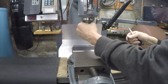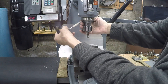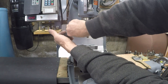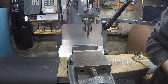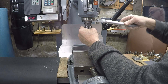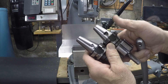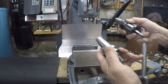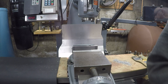Now to test it: lock the spindle, shut off the VFD, and loosen the set screws. These set screws are kind of awkward — it's one of the quirks of this particular mill. But to tell you the truth, I had a Bridgeport for a while and I didn't like the drawbar either; loosening it from the top and smacking it with a hammer to break it free isn't the greatest. So this isn't bad. You can see how tight this thing holds — pop it free. There are the pockets on the South Bend one done by the factory, and there are my pockets. Not bad. It makes this mill way more versatile — you can get tools for this mill that you couldn't use without doing this.